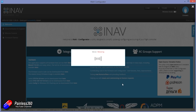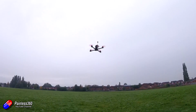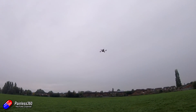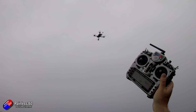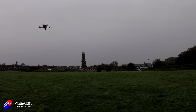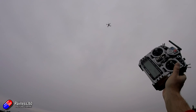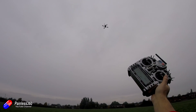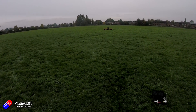The iNav configurator has a lot of extra little things. iNav has some advantages over Betaflight in a couple of key areas. The first is that it has excellent fully autonomous GPS flight modes — GPS loiter, where in a wing it flies in a big circle or in a quad it just sits there in the air. You can also do GPS return to home, which will fly back to you, stop, pause, land, and then disarm itself — rather than Betaflight GPS Rescue, which at the moment won't do that final landing phase.